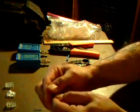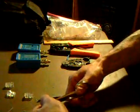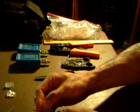On the other side, cut it at a 90-degree angle, then turn the modular connector upside down and push it all the way in. If it's too long, cut it a little more, then put it through and crimp it.